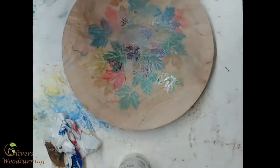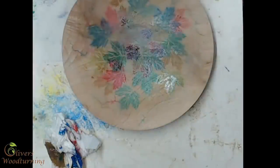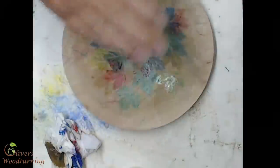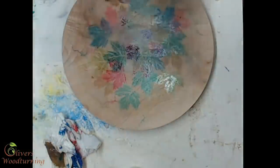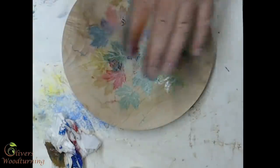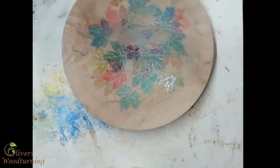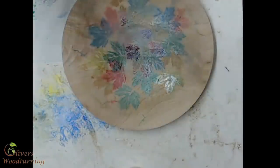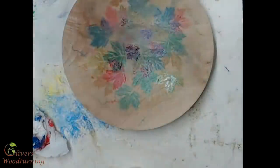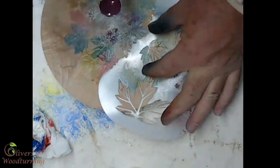Would you normally seal the wood first? No, he wouldn't. I would spray onto the wood, because this is an acrylic colour, water-based, and I would let it do its thing, dry. I would sand properly to start with. If I was airbrushing like this, I'd sand to 400 grit. I then airbrush my pattern on, and once I was satisfied with my pattern, I would spray a lacquer over it. That splashed up all over the place, got me smock, me thumb, me nose, everything. I would normally use just an aerosol lacquer over the top.